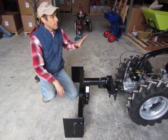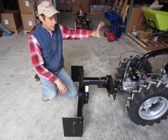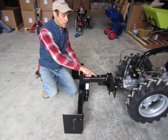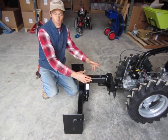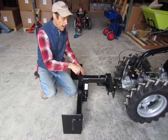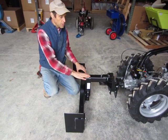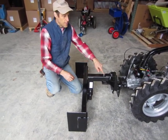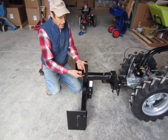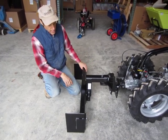If you've got a really heavy engine on your tractor — like a diesel — you'll find that this blade is not heavy enough to counterbalance the engine and the blade will want to pick up off the ground. You could use the existing bolt to affix some barbell weight plates, though it's not in a great location. Usually what we do is drill an extra hole on top and slap some barbell weights there with a big fender washer and bolt them down — people have even made lead weights and slid them in, but drilling on top is much easier.